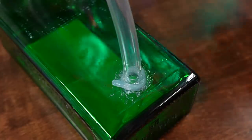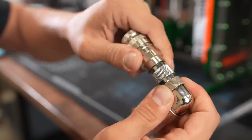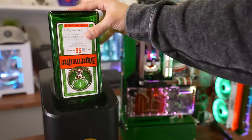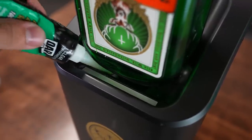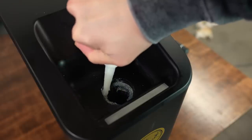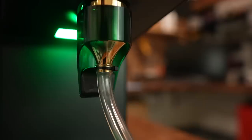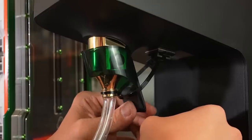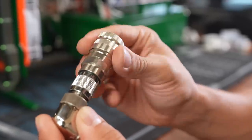The inlet tube fits snugly through the opening, but I reinforced the connection with silicone sealant for good measure before adding a female QDC to the other end of the tube. Additional caulking was also needed between the bottle adapter and tank inlet, which wouldn't have an airtight seal otherwise. Ideally, I would have seated the bottle first before sealing around it, but the tap unit's design leaves virtually no clearance to access the bottleneck. So instead, I had to apply sealant to the adapter and inlet separately before connecting them and pray for the best. Connecting the outlet tube was an easy process of sliding it over the spout and fixing it with a zip tie, along with restraining the release lever to keep the loop open at all times. Slap on one last QDC fitting, and we were ready for first launch.